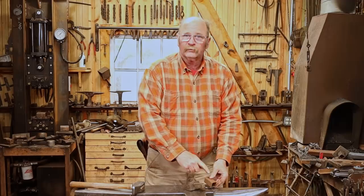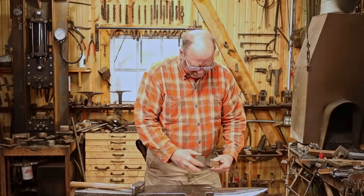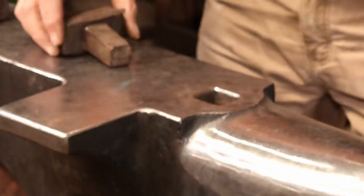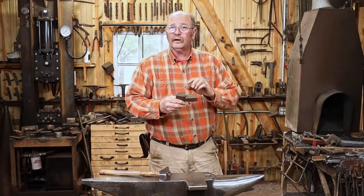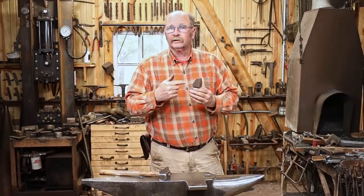I'm going to take a little piece of inch-and-a-quarter square tubing and make this fuller fit that. It's a little bit tight, but I'm going to do a little grinding on this, get that to fit in there, and then put a little bit of a weld on there to hold it. This piece of inch-and-a-quarter tubing now slides over — not quite all the way to the top. I'll give it a little tap but I don't want it to sit completely tight, because that gives me a perfect place for a weld bead that won't need so much grinding to get it out of the way.